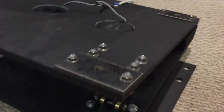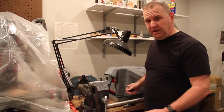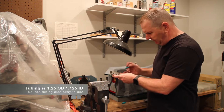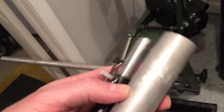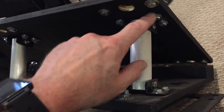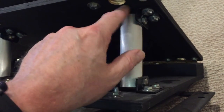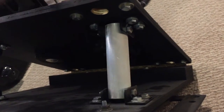This contraption made a little bit of noise, so we're making a new pin that's basically the same length as the standoff. Once both pieces are cut they're in the right ballpark. A tip: loosen all the bracket bolts first before tightening these up — it'll make it easier to pinch the tube tight. Don't over-tighten or you'll crush the tube. You could put an insert in there, but it's just as easy to run the bolt through and snug it up. This thing is not going to go anywhere no matter how much you weigh.